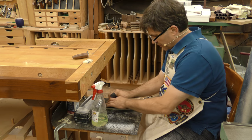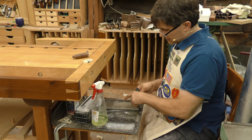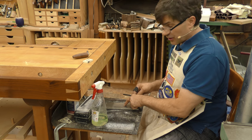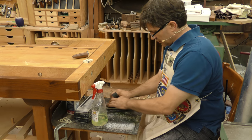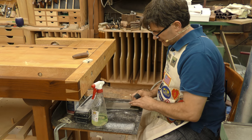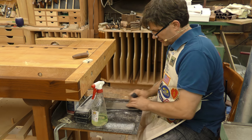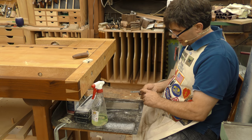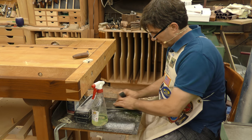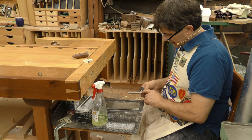As I move it forward and back, I'm replacing factory grinding scratches with 1000 grit scratches coming off of the diamond stone. As I move it forward and back, I slowly migrate to my left and then move back to the center. The reason we do that is if you stay in one spot, you'd end up with a ridge. So by moving from the center to the left and back to the center, you provide a blending area.